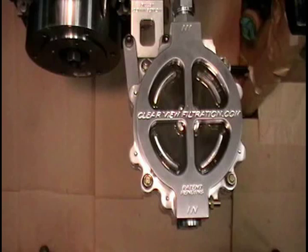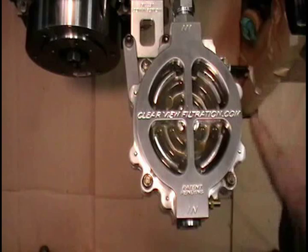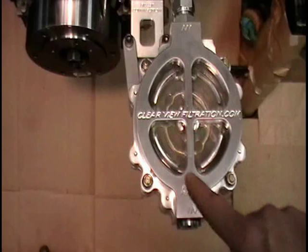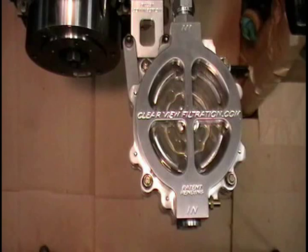Now after the engine is shut off, another quick shot of air to the filter assembly, the oil will completely drain, exposing the filter element to where we can visually see now for any contaminants at all. The filter is completely drained. I can see every particle that, if there was any, you can see them that they're on the filter element.